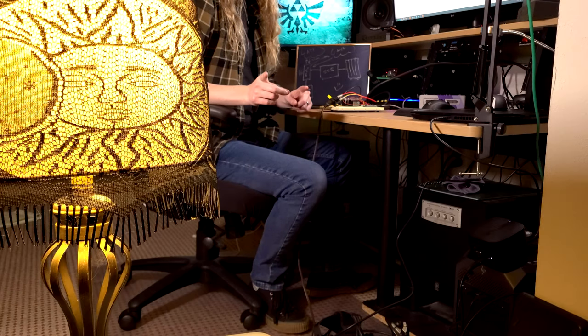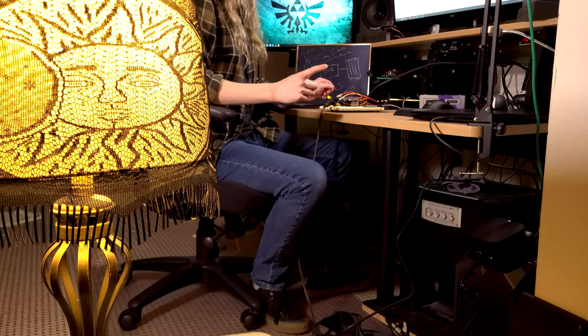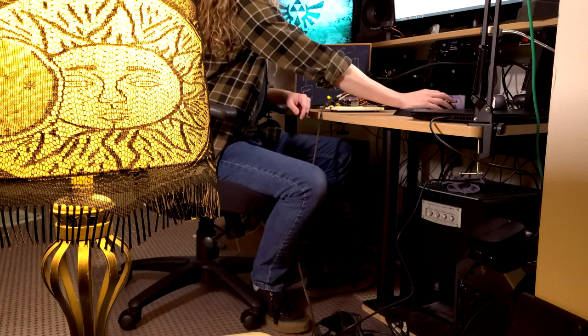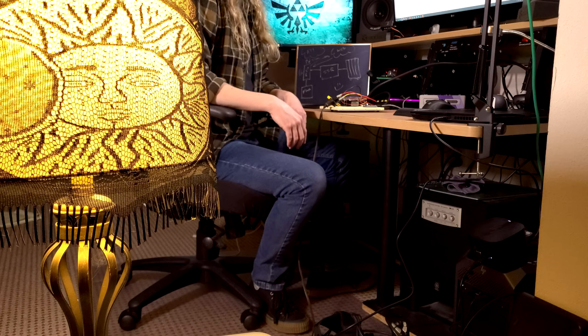Cool. So that confirms it, that power is running from the outlet into the relay and then from the relay to the lamp. Now let's assume that the temperature makes it to the right range, and we check temperature again from the API. So all that's really left to do is assemble this thing in a box and plug the heater into it.